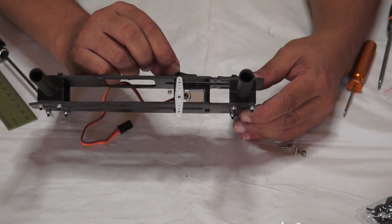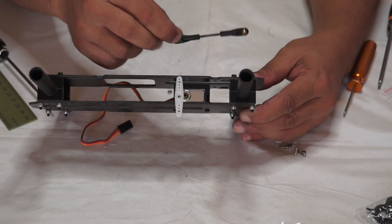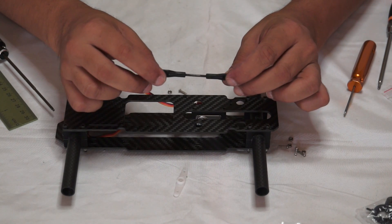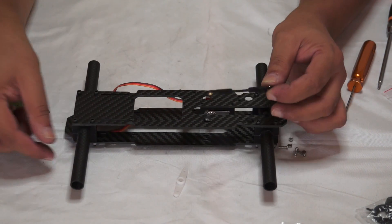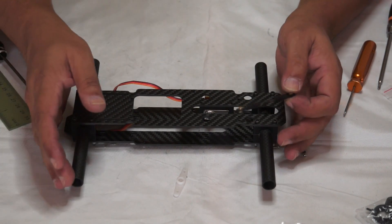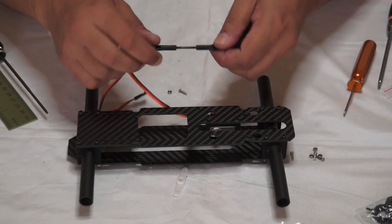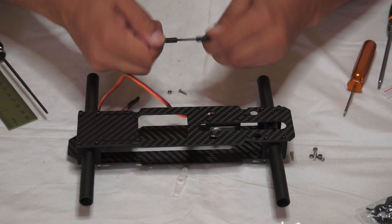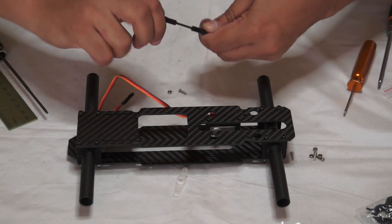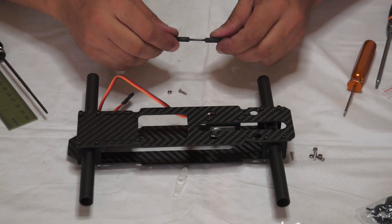It's not very important to perfectly make them perpendicular horizontally - perpendicular to the frame, 90 degrees. It's not actually necessary. If there's a little bit of gap or a little bit of difference in the length of these connecting rods, we can make do with that. Later I can describe some tweaks and tips using these connecting rod lengths so that you can let the rear arm tilt more compared to the front arm, which makes the quadcopter behave in a totally different, surprisingly amazing way.